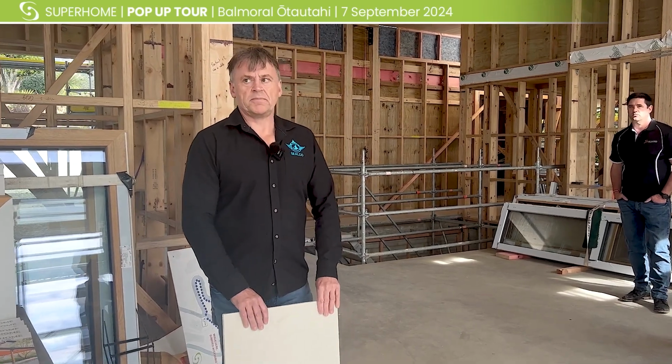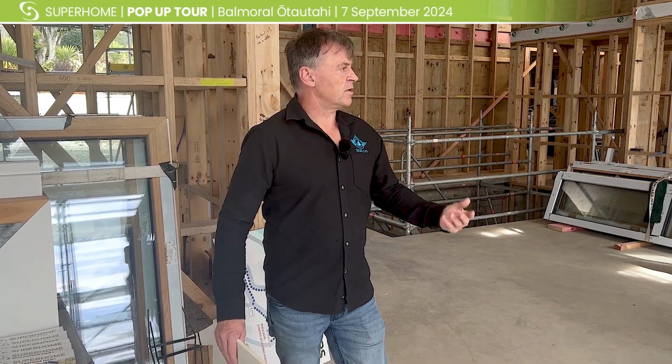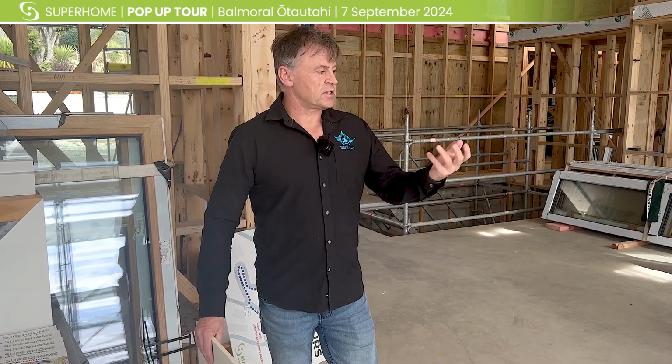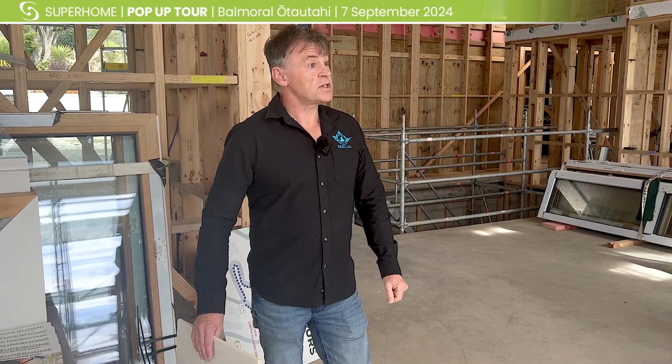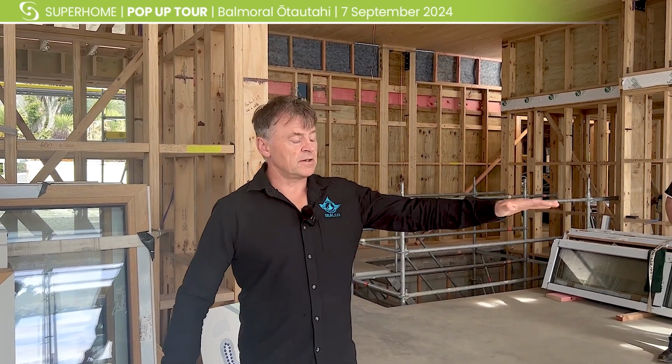We talked about, Bob explained about the thermal bridging before, meaning that the whole roof is fully covered with the insulation. There's no thermal bridging through any framing or screws or steel or anything like that. And like I say, that stops the heat from escaping and stops too much heat from entering the structure. And then you've got your membrane waterproofing on top, which gives you your overall skin on the outside and the waterproofing protection.